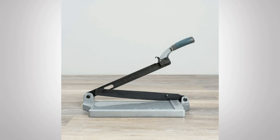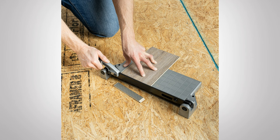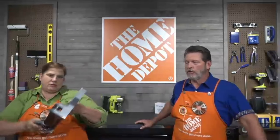The great advantage of scoring/snapping and using a vinyl cutter is that you can cut inside right as you're installing with no dust. If you cut with a jigsaw or hacksaw, vinyl dust comes up, so that should be done outside. However, both the score-and-snap and vinyl cutter methods produce very little cleanup and no dust.